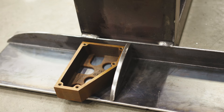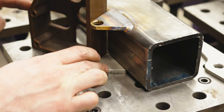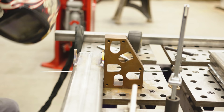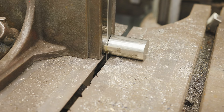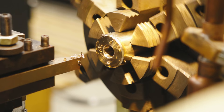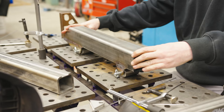I'm using my square as a reference point to transfer this tab down to the bottom — butt it right into that corner and the tab should be in the exact same spot. That's the beauty of this tool: you can use 90-degree corners as a reference with no measuring required. Now it's time to put some wheels on this frame. Normal off-the-shelf wheels just won't work, so we have to make some that can stand up to the weight. I'm choosing inch and a half solid stainless steel for the wheels to keep them strong and keep ground pressure to a minimum. The tabs are welded on nice and straight, the pin goes right through, and we have our Fred Flintstone wheels.